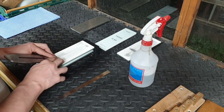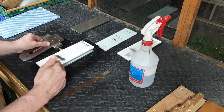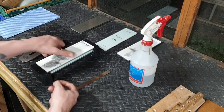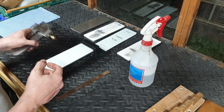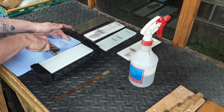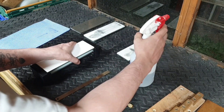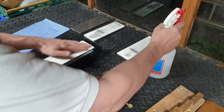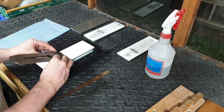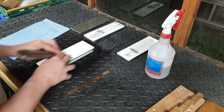You'll probably have to pay more attention on your higher grit stones than your lower grit ones. You can see all the swarf coming off the 6000 grit stone — they're very, very abrasive stones. What I generally do between my 6000 and my finishing stone is wipe the swarf off because I don't want to contaminate my stone. I haven't found much cross-contamination with these Shapton ceramics, but on some stones it can really make a difference.